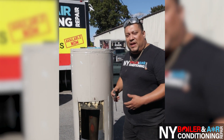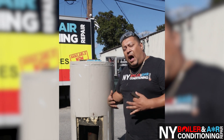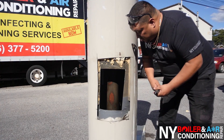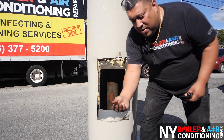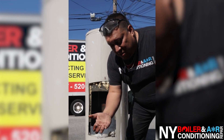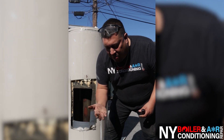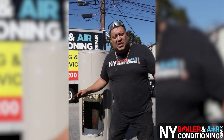That's pretty much it. Why not open it up and see exactly what's going on, because now you have a better visual understanding of how a hot water heater looks internally and how it works. Also, this is the sediment inside the water heater when you don't do your maintenance — you see all this crud? That's in your water. This is called scale. It's not that bad but it's been sitting here for quite a while. You do not want this in your bathing water. So guys, do your preventive maintenance. Preventive maintenance is key to everything to do with HVAC and plumbing.